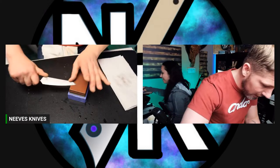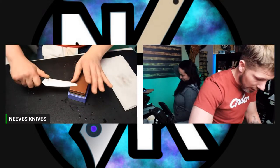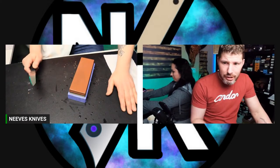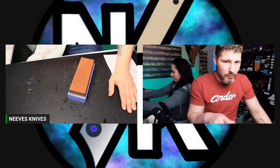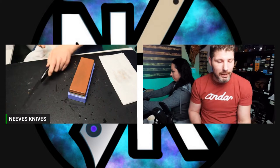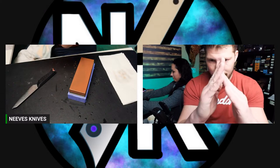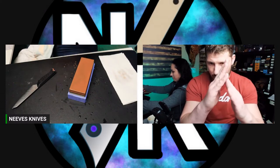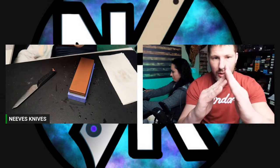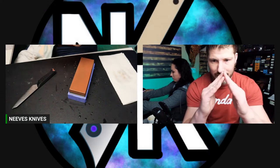The burr removal is one of the most important parts, so don't take it lightly. It is extremely important. You can have a super sharp edge and your edge is low quality all because of the way you created your burr and deburred. Think about it. When you're setting a bevel, you're sharpening on this side, creating a burr, sharpening on this side, creating a burr. Your last burr, which would be the tips of my fingers right now, you want to knock off so that you reveal a perfect apex.